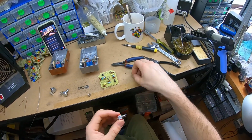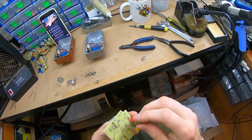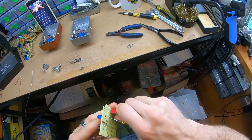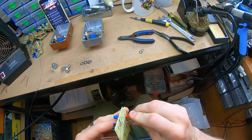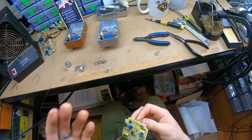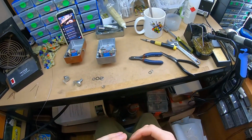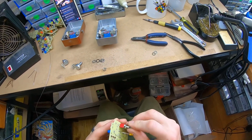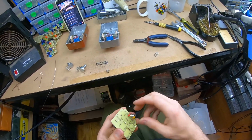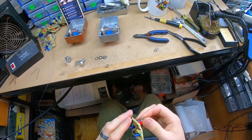Alright, so I'm recycling all of this hardware on this switch. That's tight. PCB houses, depends how they run their router. Sometimes it's perfect. And I've changed this recently, so now they're going to be all loose, just in case. So they're going to be just right, or a little bit extra, and never too tight like that. But these switches, it's not going to die for the life of the pedal, I don't think. It is one of the weaker parts of the pedal, and still going to be interchangeable if you ever had any issues.